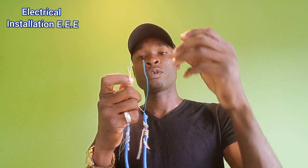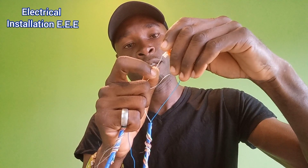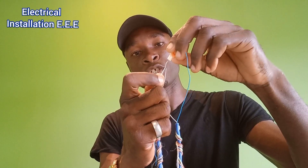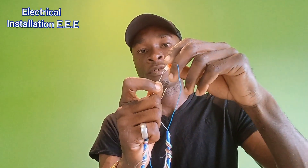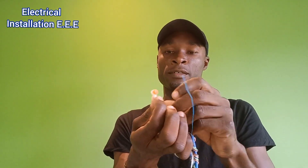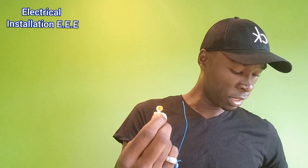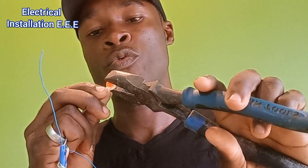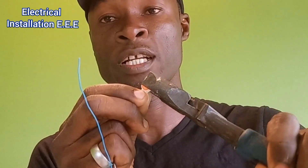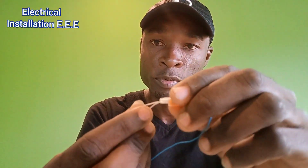So what we're going to do now is insert these wires. I'm going to go with the white first. We insert it right inside — there is a hole right there. If you just push it in, it can easily come out. Notice there is some gel inside — that's very important. So I'm going to insert it right here, and insert the other one right here. Then you have to get pliers and squeeze the colored part right there — that's where you clamp it.